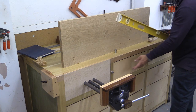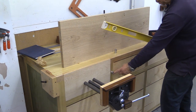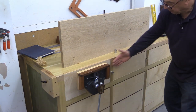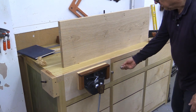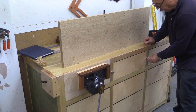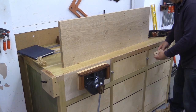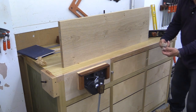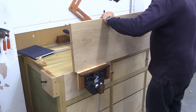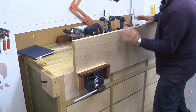I've now put a couple of dog holes in the front of my bench which line up with the bed of the vise. I used a spirit level across here and then judged 10 millimetres below that to get the centres of a pair of holes that now allow me to have something resting across here — like this lump of oak that I'm about to plane. These holes have been chamfered with the UJK chamfer tool, and I can now use any of the UJK bench dogs to go in there. These are just the ordinary ones that push in. Because these holes don't have fresh air behind them, they're going to be slightly tricky to get out, so I'm using my little removal tool. But actually that's a good thing because it keeps them in place when they're in use. So now I can put this piece down — it's now resting in three places. Tighten it up and now I can start planing.